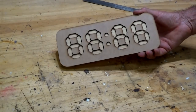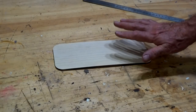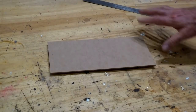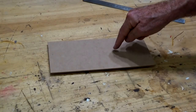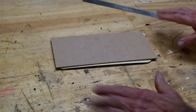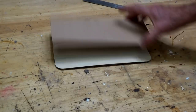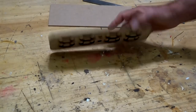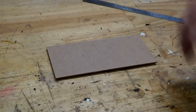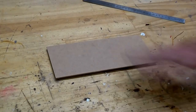The only way around that is to put veneer on both sides to create a balance. Because we have to laser-cut that, it becomes a bit problematic, because obviously one side can't be laser-cut all the way through. So what I'm planning to do is take a blank piece of veneer, veneer one side, then laser-cut through, and then add just a blank piece of veneer to the other side. Hopefully that is going to stay relatively flat. My laser can cut up to about 4mm fairly easily — after that it's a multi-pass thing and gets a bit messy. But obviously if you have a CNC router, go for it.